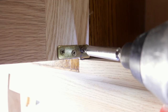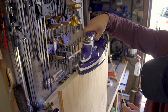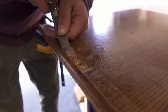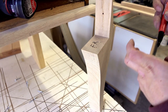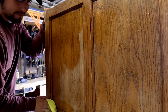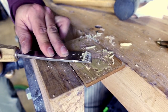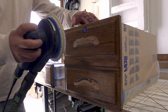Pocket hole screws are obviously my go-to on this project. I might as well check to see if the middle door fits while I'm at it — and it does. A few last extras include edge banding the front of each shelf, cutting a finger pull into the bottom side of the larger pullout tray with a track saw, a chisel, and some sandpaper, then marking where each component goes, scuff sanding the existing finish for better adhesion, cleaning the rest of the aged grime, covering hardware in plastic, repositioning the misplaced drawer face, and finally sanding the areas that have the handle marks.